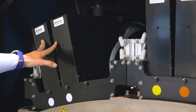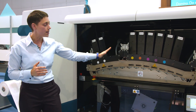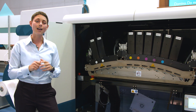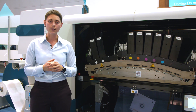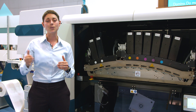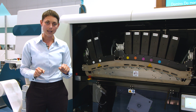After the two double bars we have an LED pinning lamp. This enables us to gel the ink, allowing for the overprinting of the remaining colours. The configuration of this machine is a seven-colour configuration; however the press is available as a four, five, six, or seven colour press. With our four-colour CMYK configuration we can print over 70% of the Pantone range. With the addition of orange and violet we can print up to 92% of the Pantone range, enabling us to print common brand colours such as Reflex Blue, and our ability to print spot colours actually reduces ink consumption.